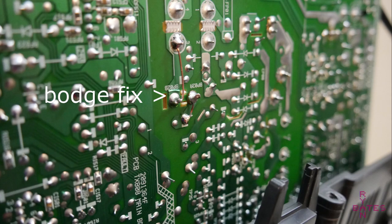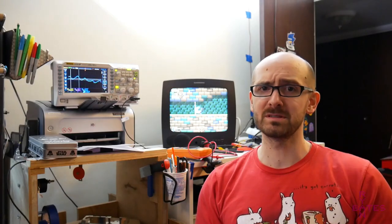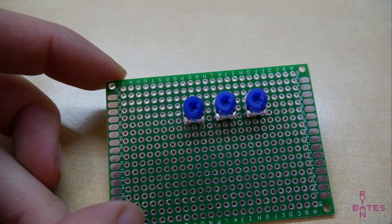For future reference, I recommend making a printed circuit board for this with 1K potentiometers for the RGB lines so you can dial down the actual peak-to-peak voltage signal recommended for those jungle chips. After that, I just buttoned it up — it works, and I'm going to leave it alone. The next TV I try this on, I might have a little more preparation with a circuit board that has some tuning built in.